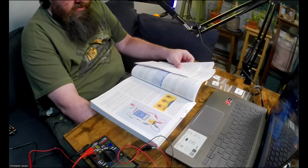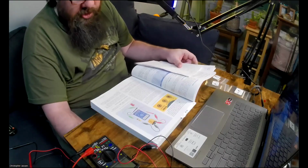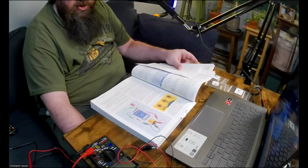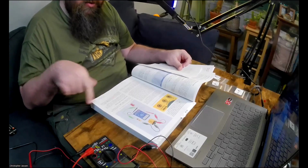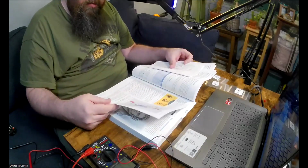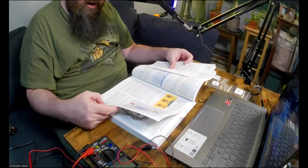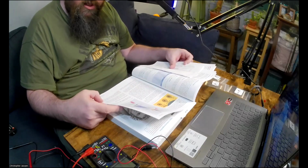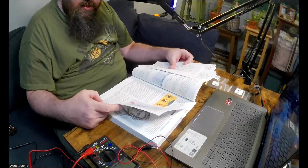What if you didn't have me telling you how much current you would be measuring? You could do a calculation, which I'll explain in chapter 4, or you could start by using the socket labeled 10 amps or 20 amps and work downward. Current in the LED circuit. So here we're going to use our multimeter to test the current. I want you to rebuild your circuit with a new LED. Make sure you use the 1.5K resistor this time, not the 150 ohm resistor, and definitely not the 15 ohm resistor. You don't want to mistreat more LEDs than necessary.